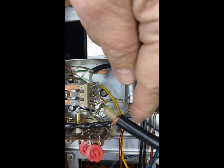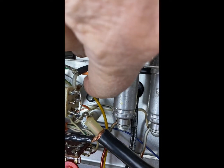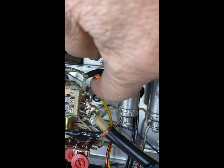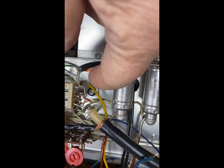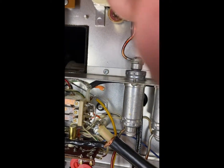The next step involves removing this yellow wire from the bottom of the relay. It's a common connection, and they make it pretty clear to pull the wire off, clean it up, but make sure you clean up the connection, because this wire doesn't go back, but a resistor and another wire does. So pulling that out next.